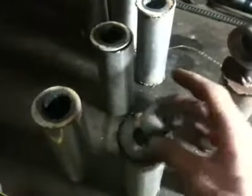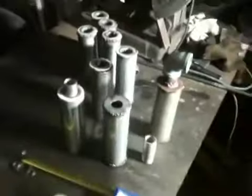We typically cut off the pipe fittings so that we can weld them — you don't have to use the whole fitting, just weld it on after you've got the whole assembly. It needs to be torched out so you put it on there. It's welded on but screws off, so it's modular and replaceable. We like the pipe fittings — they're modular and replaceable. That's about it for the muffler.